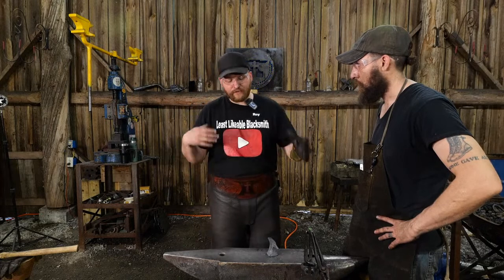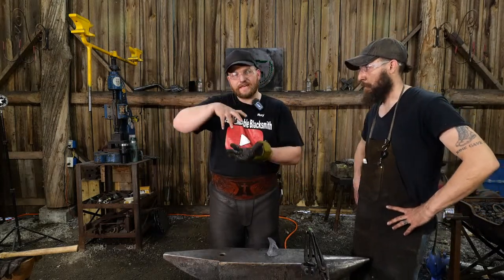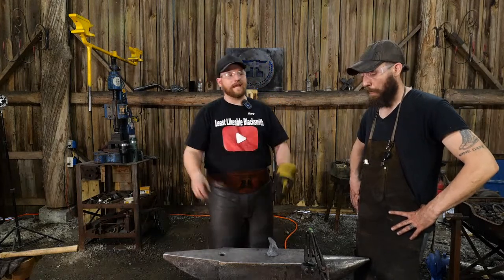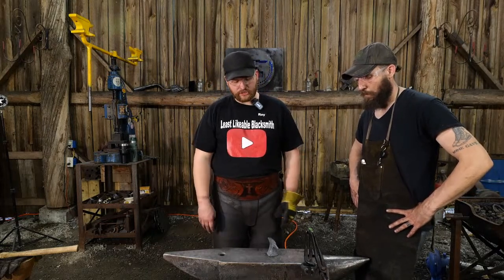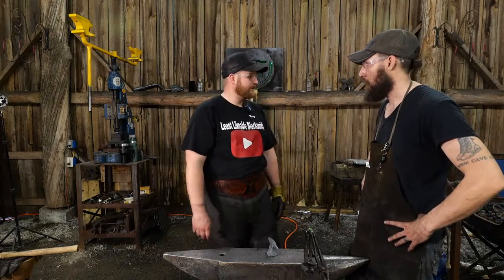So just keep that in mind when you're forging stuff like this. The fatter that thing gets as it gets compressed, you're working on a thicker and thicker cross section. It's not a thinner and thinner cross section like we normally do when we're drawing something out from something thick to forging thin. But it's a fun challenge, and maybe we'll do one. Like I said, the 500K.